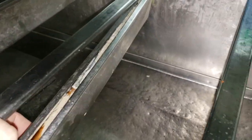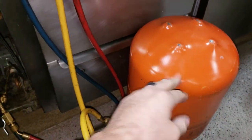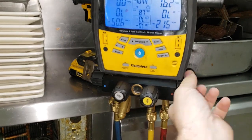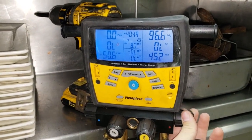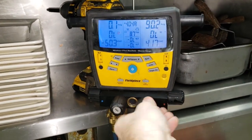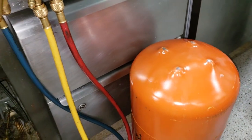You see this rail right here is busted and it's just hanging. That's where the refrigerant lines come in, loop, and then come back. We've got our refrigerant cylinder hooked up. We're going to go ahead and open it up — already purged it. Pressurized on the high side, put a little bit of gas in there. That's more than enough. Shut it off and then we'll put nitrogen on top of it. That is just a tracer gas.